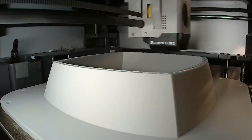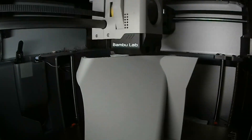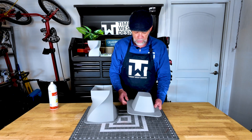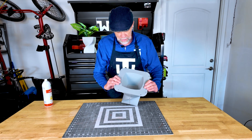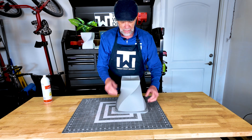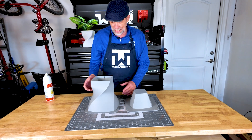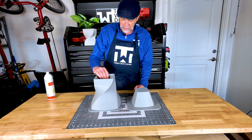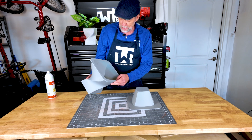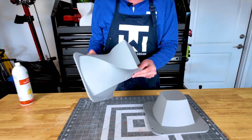It's always gratifying to watch the digital file turn into something real. The 3D printer is hard at work and it's almost done. This is a pretty simple file — just this section and this section that goes together like so, gonna look like that kind of shape when it's done. When I drew this up with the taper and the twist I thought it probably could twist off the mold, but then I printed it and I was like, nah, I'm not so sure about that. So I cut it — I have a split in here so I can help spread it open.